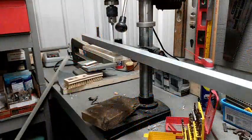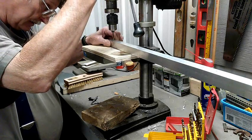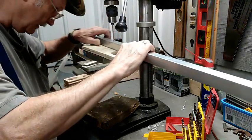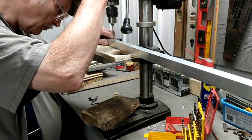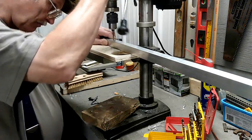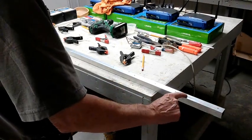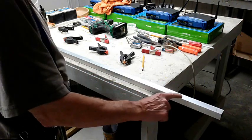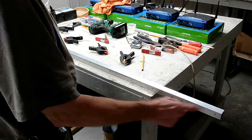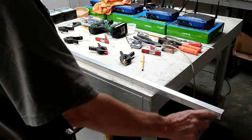I have the table where I want it and will lock it down. I am drilling these with an eighth-inch drill bit first, before drilling with a quarter-inch. I have my holes drilled — this is my reflector, that is my dipole, first director, second, third, fourth, and so on. If I flip it over, I have the exact same pattern on the opposite side. Now I am going to drill holes across the top to put in pop rivets to hold all the elements in place.